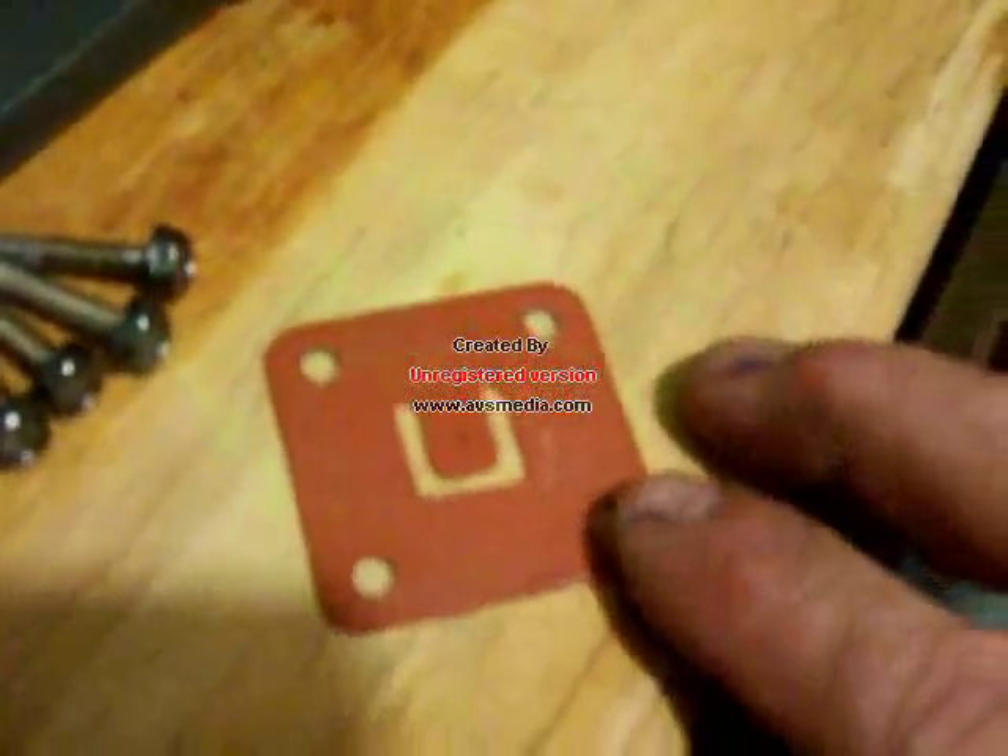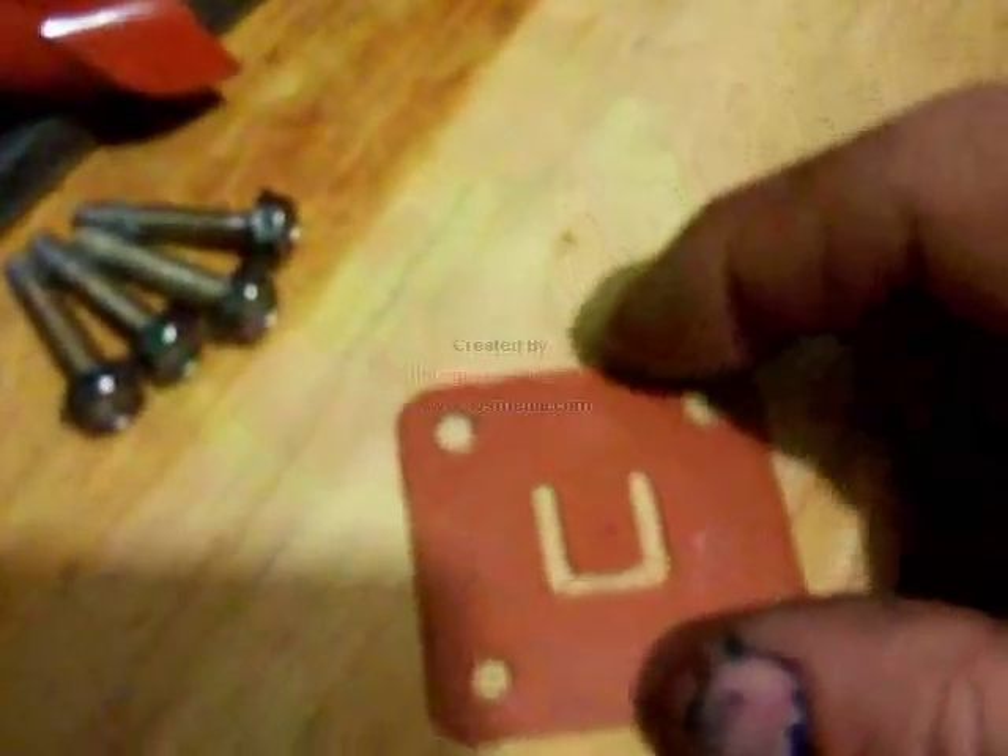Although I'd like to replace the diaphragm as soon as possible. I tried picking up this silicone gasket material, but it's a little soft. It has a duro rating — which is the hardness of it — and the duro rating of this stuff was 10. But I figure I need more like a duro rating of 70. Big difference. It's just some kind of red silicone gasket. I'll find it someday, but for now this one is going back on.